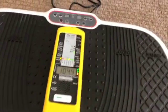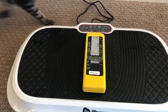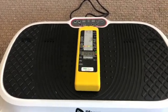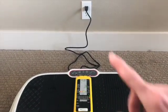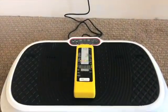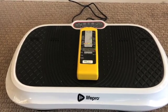Wow, holy smokes — just plugging the unit in made the electric field go up to 104, and this isn't even on. This is not even on, it's just plugged in. That is common and it's good for you to know that whenever you've got anything plugged in — no matter what it is, a lamp, a blender, a toaster — you've got a hot wire bringing voltage up to the unit ready to go, so it is going to increase your electric field whether or not the device is on.